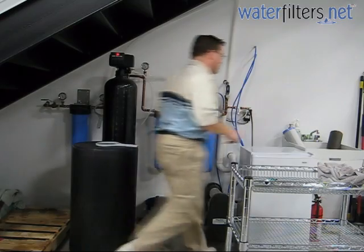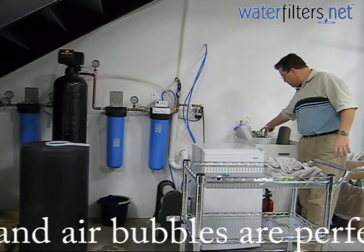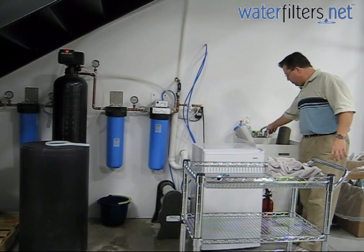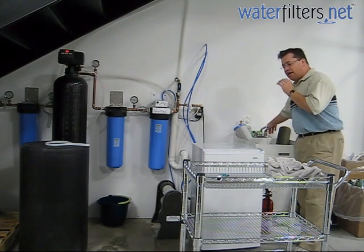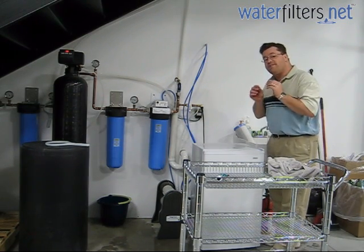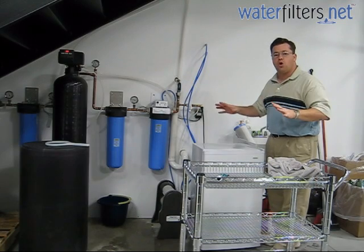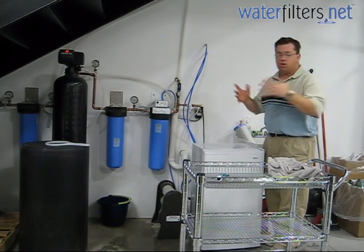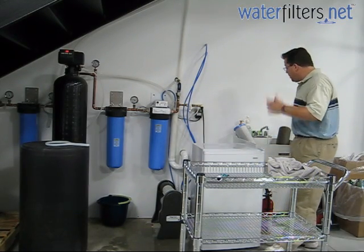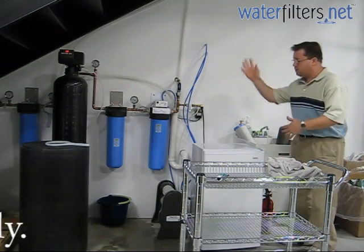We'll run the system to let the air out of it — there's probably a lot of air built up. Don't be surprised if you get some sputtering and spurting. It's perfectly normal to find small air bubbles in the water. Also, with the carbon filter, carbon fines — little tiny black pieces of the carbon that are loose — it's perfectly normal and it's harmless to ingest, even though nobody probably wants to. That'll rinse out after you flush the system. It's a good idea to just crank the water on, walk away for 10 minutes, let it purge out those carbon fines and any air bubbles. Then you're good to go.